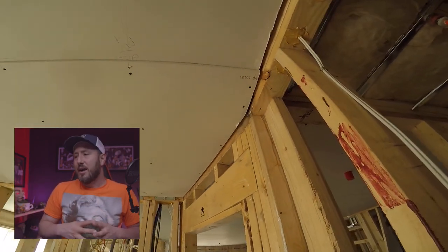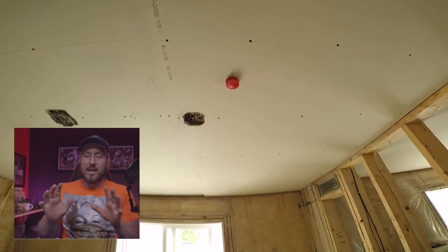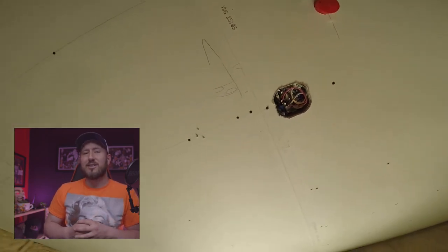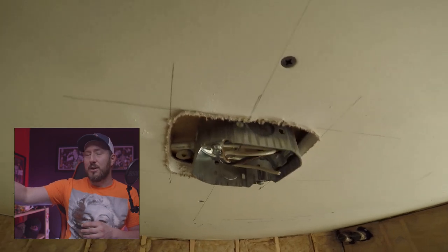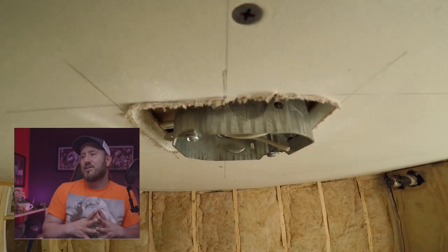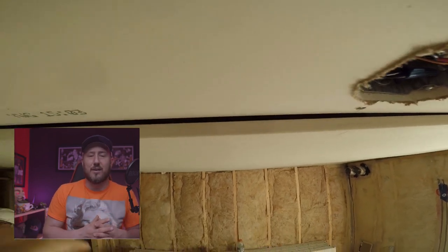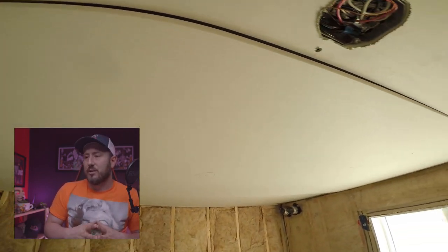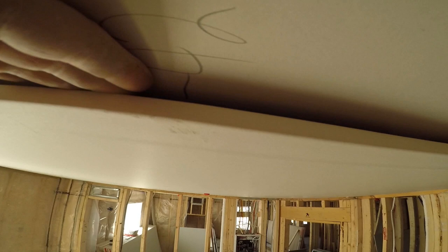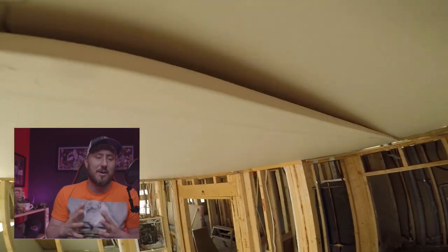The boxes are very low. On the second layer, you can't pre-cut the boxes — you have to router them out. Mark centers; the sprinklers are circles. They're inch and seven-eighths — not quite two inches. We do a two-inch hole on the first layer and then inch and seven-eighths tight on the second layer, and they work really well. You can see how low the sheet is — I can put my fingers in there. That's how you router out the boxes: mark centers, router them out, and that's it.